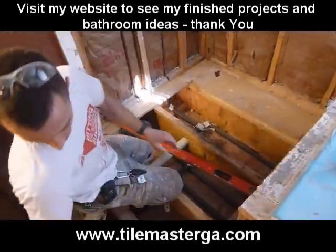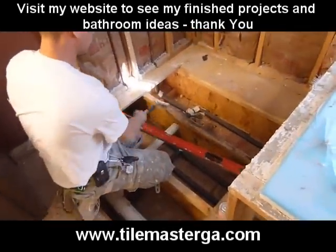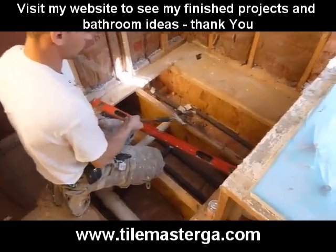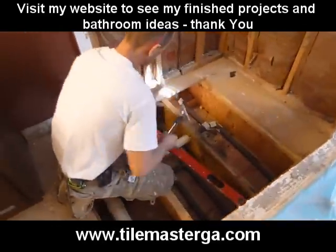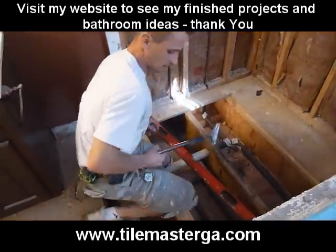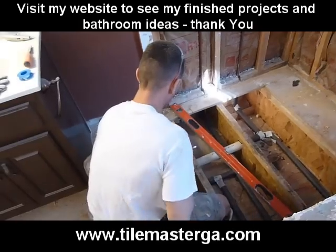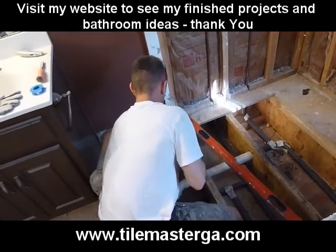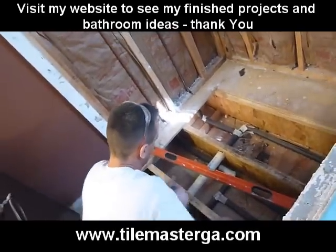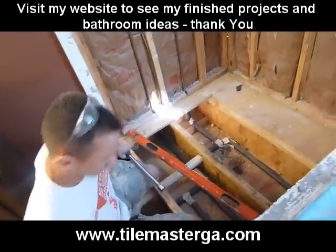So what I did in the winter: I cleaned all the joists to make sure there's no old glue remaining from the old board on top, so the new board will be nice and flat, as well as the original floor was. I used a scraper to remove any old glue residues and eliminate all the nails.